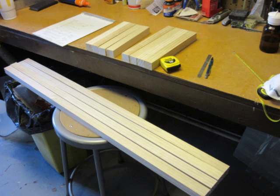This photo shows four long stringers for the long dimension of the case, and then four short stringers and four more even shorter stringers. All of them have the same cross section, in this case 1 1/4 by 1 1/4, and it becomes apparent why four of the short stringers are shorter than the next longest ones.